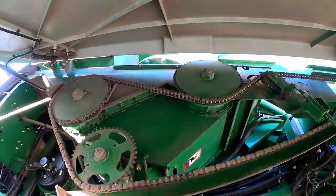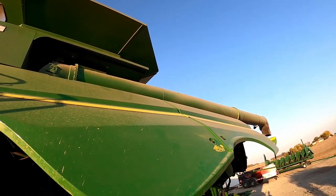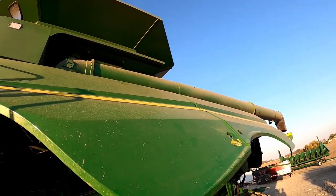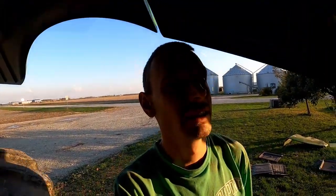These augers will move the grain out of the grain tank to a vertical auger, and then it will take it up and out the unloading auger, which swings out. So all that stuff has to get cleaned — every kernel has to get cleaned out if I can. It's a hard job, but definitely helps my premium if I don't get a load rejected. Because if they find GMO crops in organic crops, they'll reject it.